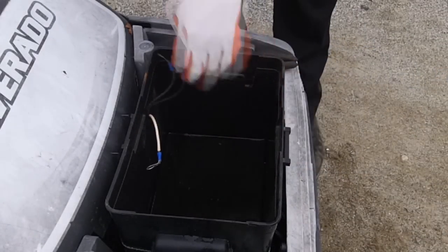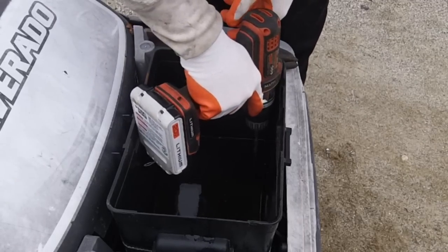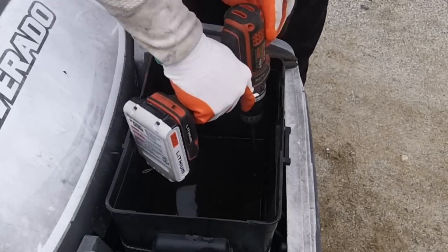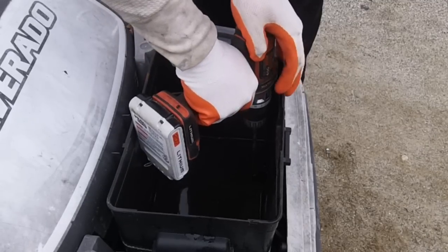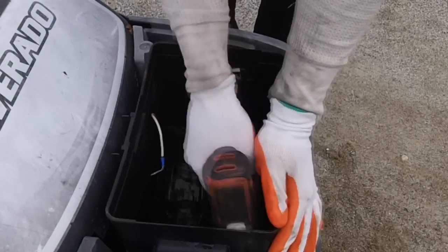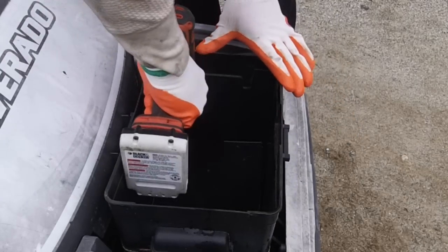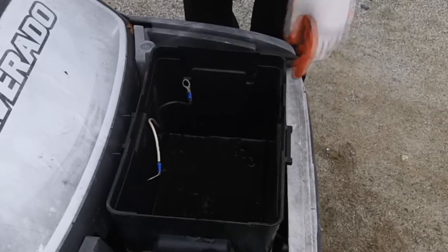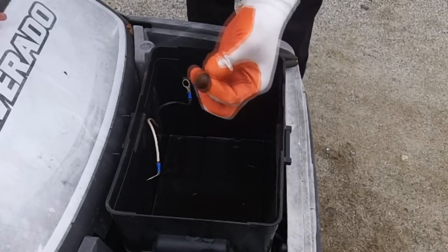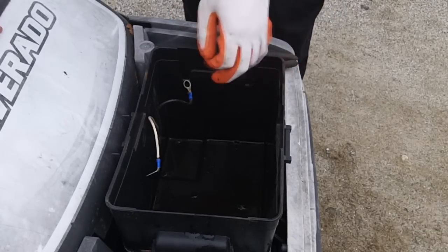After undoing the connectors, getting the battery out and the charger out, we actually found a pretty significant amount of water in the bottom — judging from the drill blade, about three-quarters of an inch deep. No wonder the charger may have come to a demise. We're going to drill four holes in it, which will definitely help with drainage, and hopefully we won't have that problem ever again. The fact that I just found acorns in it — in a sealed box — I think I figured out why the cover wasn't quite on properly.